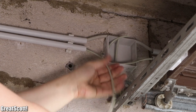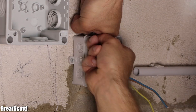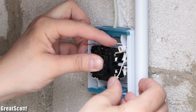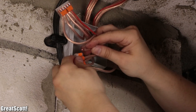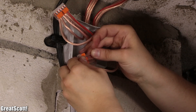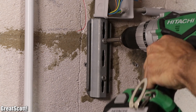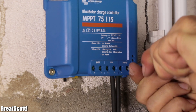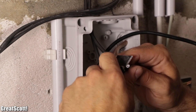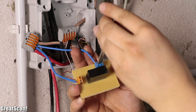That means we pushed all the required cables through the pipes and partly into the junction boxes, cut them to size and wired up the switch and both sockets. Afterwards, we connected all the LEDs in parallel with WAGO terminals, added a mounting for the inverter to the wall which was then attached with zip ties, and continued by adding the load wires to the charge controller, which we then connected to the inverter and the relay circuits inside the DC junction box.